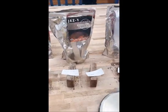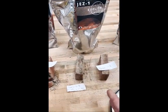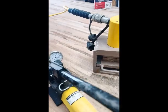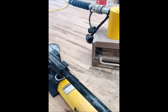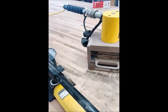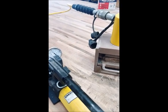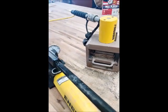I'm going to try one of these blocks from the Jezero Delta simulant at 5% water. I'm actually going to use the one that I put less pressure on — the 1,200 PSI block — and see what that tests at compressive strength wise. It just about got to 3,000 PSI on the gauge before it broke, which is easily over 1,000 — probably almost 1,200 PSI on the break. So another really good result out of this Mars Simulant.